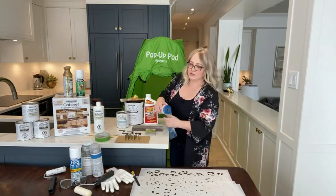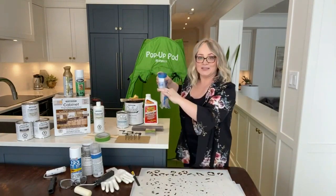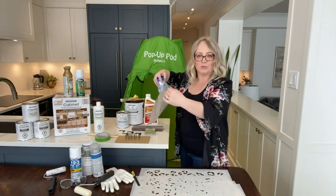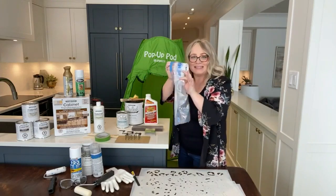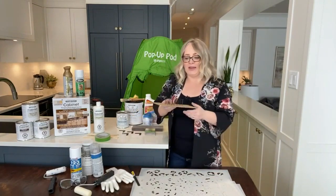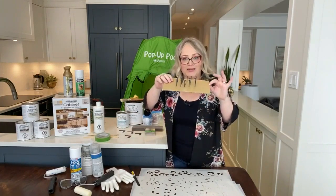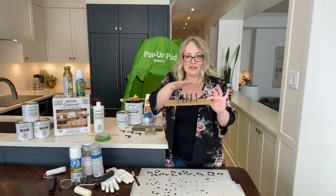There's also a drop cloth with tape on the edge. I use it around the top on the inside when spraying. You can unravel it — it stretches out really long — which is great for baseboards. I used it when painting the piano to tape off the keys and inside workings so dust wouldn't get in. For the campaign dresser, I spray-painted the L brackets and handles from black to gold, and also spray-painted the exposed screw heads. The easiest way to do that is to stick the screws into a piece of cardboard standing upright, and then give them a quick spray.